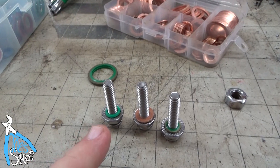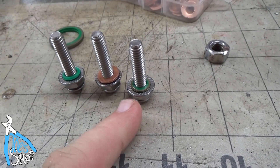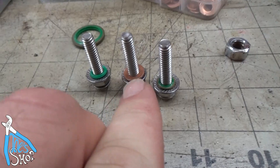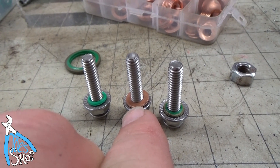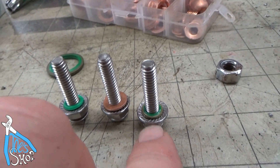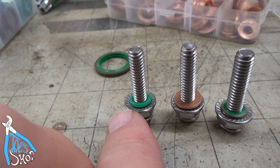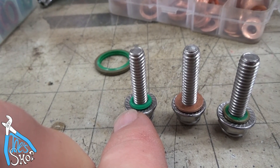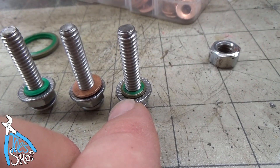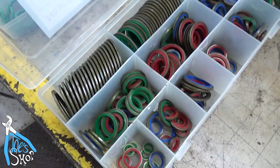This is not a great demonstration, but on the left we've got a regular O-ring, in the center a copper crush washer, and on the right one of those metal bonded rubber gaskets. We've effectively split the difference — it's a middle ground. I think if you can't tighten things down a lot, this constrained O-ring would be a good option. And if there's any pressure on the inside — like in the hydraulic system, there was nothing to keep the O-ring from blowing out — the metal bonded one holds everything together. It's not a panacea, but it's another option to have in the arsenal.